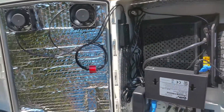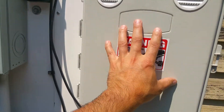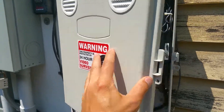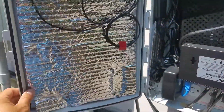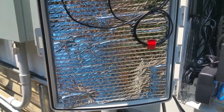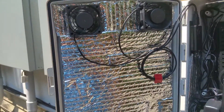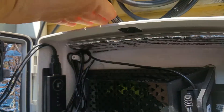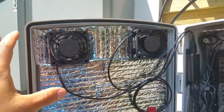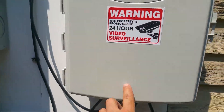To recap what I did to make this work: initially I put insulation on here because the sun hits this plastic cabinet and creates a lot of heat inside. I put the insulation on thinking it would stop the heat, but that didn't work. My next step was to add these vents, and that seemed to do the trick. I also put more insulation on the top where the sun hits, but really I needed these exhaust vents to make it work.